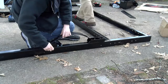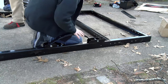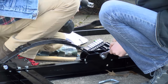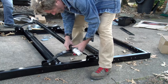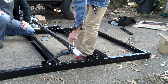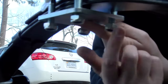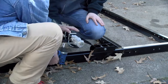Setting the leaf springs in — the bushing side goes to the front and there's a larger set of bolts to push through. On the back, the same size bolt goes over the top of the rear of the leaf spring. Once we have those tightened up, it's time to see how the axle fits. There's a divot on each end that'll help you line up to the top of the leaf spring. Once you have that, take the U-bolts and set them on each side of the leaf spring. Using that plate, set those on and screw down the lock nuts. The instructions showed it with washers but instead it came with lock nuts.